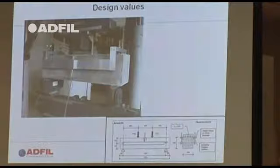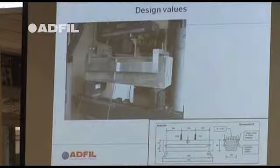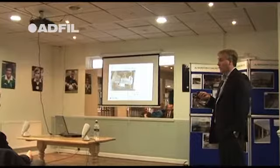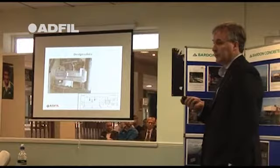The information from which everything is based for concrete floor slabs is the same as for normal concrete: flexural strength. Polypropylene and steel fibres do not increase the flexural strength at normal dosages. If you go to very high dosages with special concrete you can increase it substantially, but for the majority of jobs replacing one or two layers of mesh, you need a dosage typically between 4 and 6kg per cubic metre.